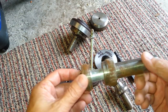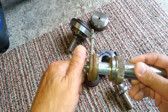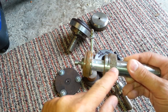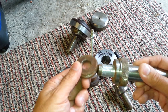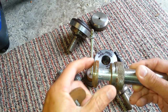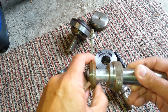This is the tool for the nozzle guide vane. You might have to remake the ends or turn this bit back a little bit further, depending on what your step's like and how you want to locate it. But again, you could turn that round and machine it to fit yours at this side. You might have to sleeve this up, or you can't really turn that area down.